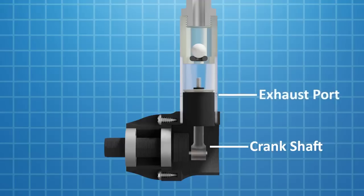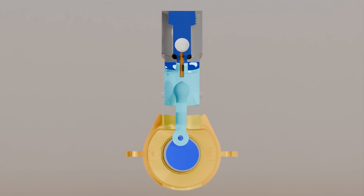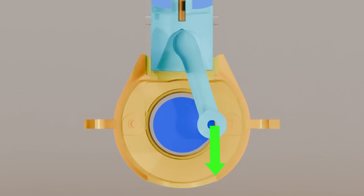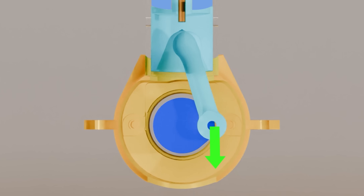When I say Tom's design is poopy, I don't mean his actual design. What I think is crap about this design is the actual piston-crankshaft mechanism. When the piston reaches the apex and opens the valve, you have maximum pressure, but because the connecting rod is basically vertical, almost no force is being transferred to the crank. As the piston is pushed down and the gas expands, we get a better angle to transfer the force, but now the gas has expanded so you don't have as much pressure and thus not as much force to be transferred.